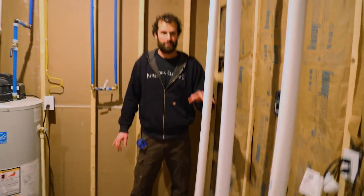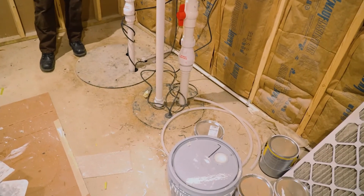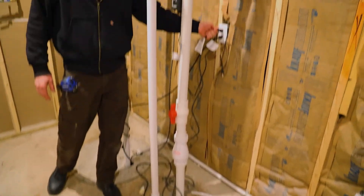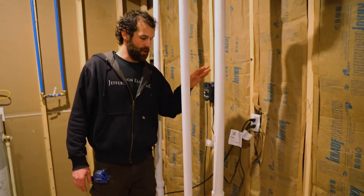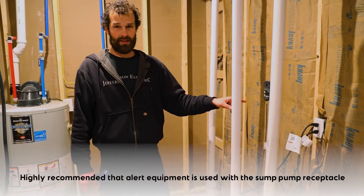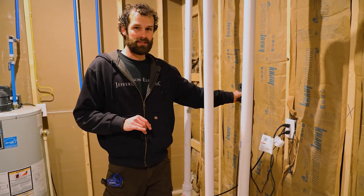On my left we have two sump pumps — one is actually a lift station in this case, and one is a sump pump. Both are serviced by a dedicated 20-amp GFCI receptacle. It is highly recommendable to use monitoring and alert equipment so that if power fails here, it is of first notice and first importance.